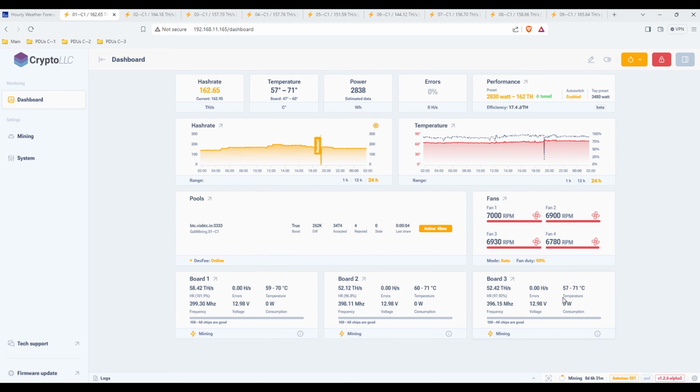So that means that one of these hash boards could have ASIC chips that are just a little bit better quality than the other batch. So you can see, like this one over here, it has 70, 71, 71. See the speed over here. But if you go down to 166, which is faster than that miner, you can see it actually has lower temperatures for the board, even though it's hashing faster. That just has to do with the ASIC chips coming out of the fab at different quality, even though again, it's the same exact company, made at the same exact place. It's just how it is.